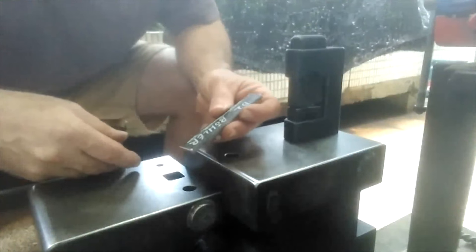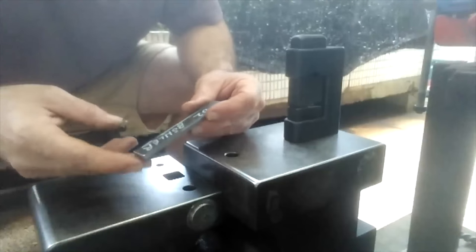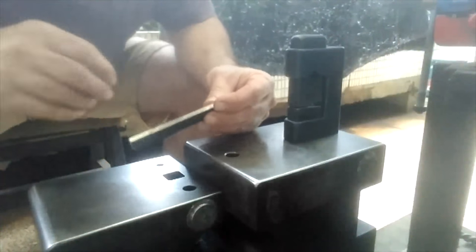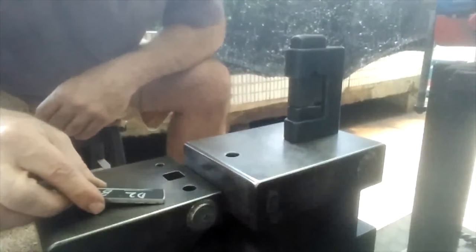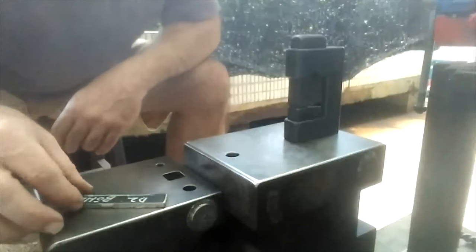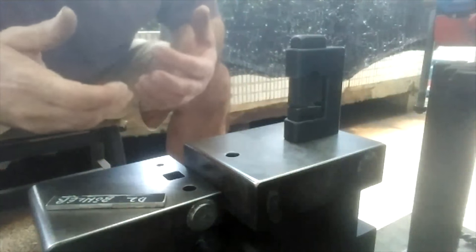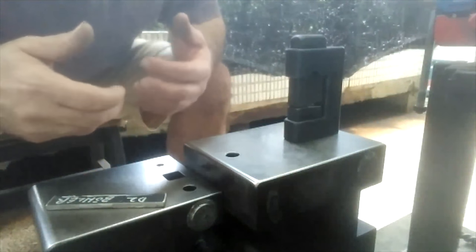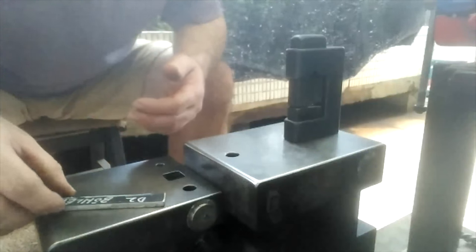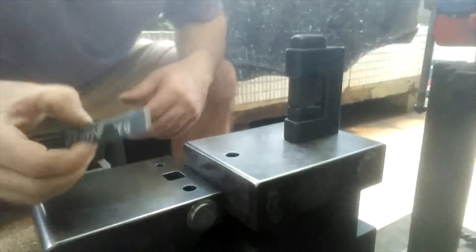such a small piece. Air hardening steels like D2 or H13 or S7, the property that makes them so useful for hot forging is that they maintain a high hardness at a very high heat. And I think that's not via carbon only, it's actually through the addition of alloys, mainly chromium. And that's also what makes it very hard to hand forge. But yeah, I'm going to use this piece.